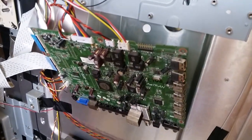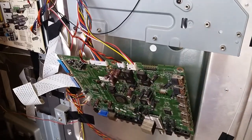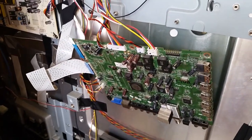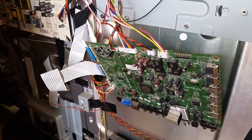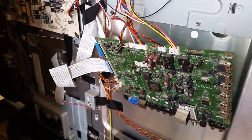Well, if the memory is corrupt, it depends on where it is corrupt — it may hang later on. But not with those chips; those are chips that don't have a single bad block, or even if they did it would be rearranged by the writing software. This is how we test them and how we know those chips are working. I admit we don't test every single piece of smart TV functionality, and I don't find that problematic, because most of the time where people have problems it's either hanging on the Vizio screen or never starting to begin with.